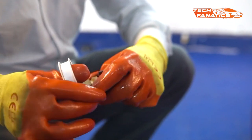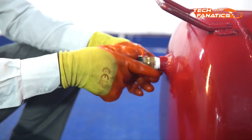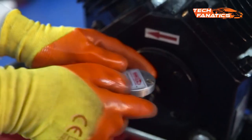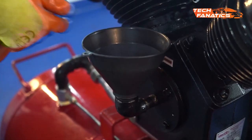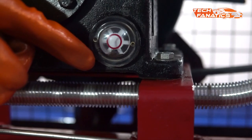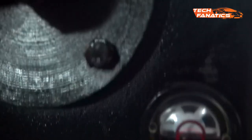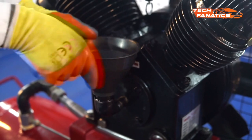Over here we'll install a safety valve. We'll screw it on the left side of the tank opening. We're gonna use hands first and then move on to the wrench at the right setting to tighten it. Now we'll open the oil cap and fix an oil funnel. Then we'll pour 20W40 engine oil through the funnel and we'll keep a check on the oil gauge till it reaches 80% occupancy. Once it's filled sufficiently, we'll unscrew the funnel and cover the opening with the oil cap once again.